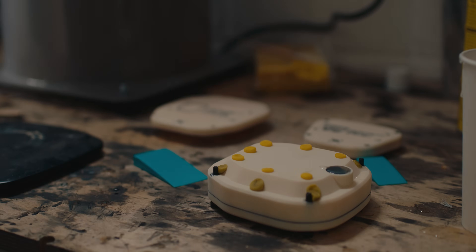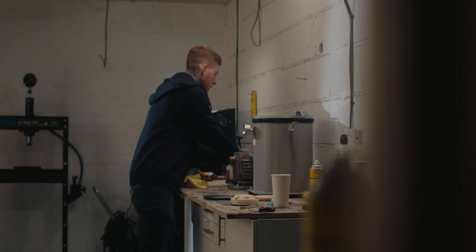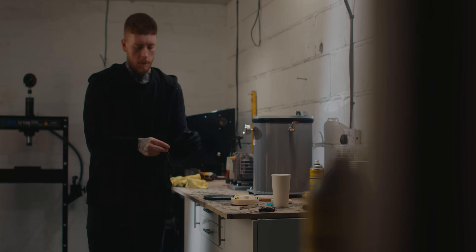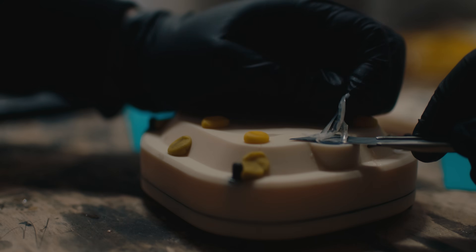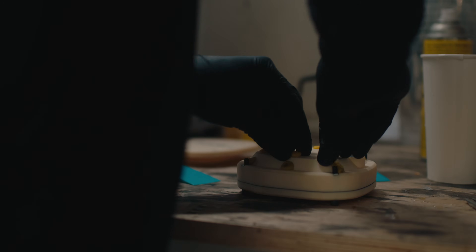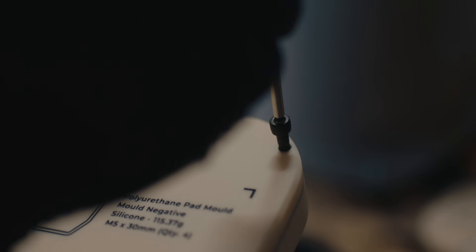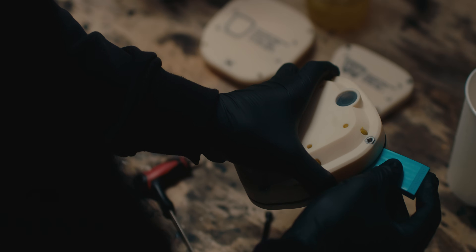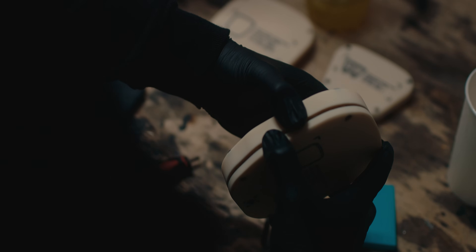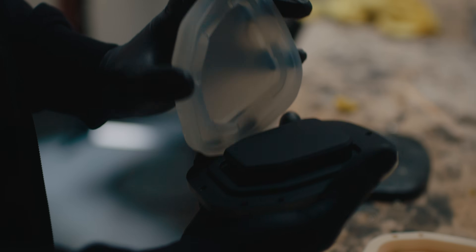You could heat the silicon to achieve a full cure in a matter of hours. I usually avoid this though, as I don't like running the risk of the master or the materials expanding — the expansion can throw off the tolerances of the part being moulded. Now it's cured, I can take it apart and get ready to pour in the resin. I never actually touch any of the surfaces of my moulds, because touching the surface would leave a mark or print that will be present on all the cast parts out of that mould. This is more noticeable on a surface with a uniform finish, and as I can't prep or sand the final component, I want to make sure it stays mark-free.